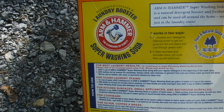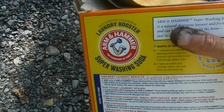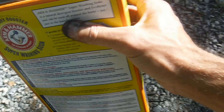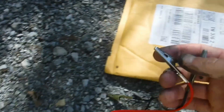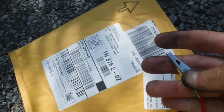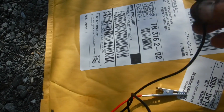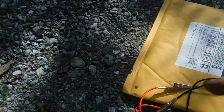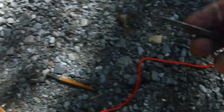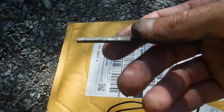Here are the items we're going to need to do this electrolysis. I'm using Arm & Hammer Super Washing Soda — you can get this in the detergent aisle at big name grocery stores, Walmart, that sort of thing. I also got these little clamp wires at Walmart. They have alligator clips with a red wire and a black wire going to another set of alligator clips. I'm also going to use these little square iron nails for my anodes.